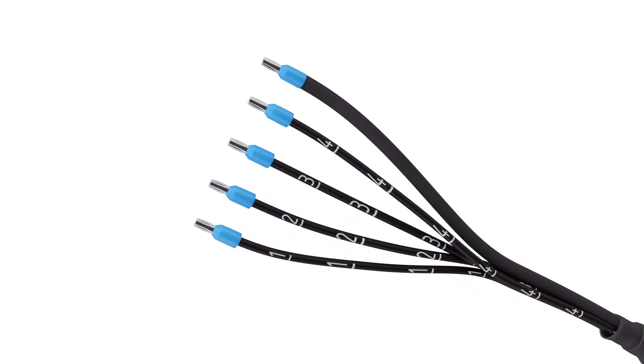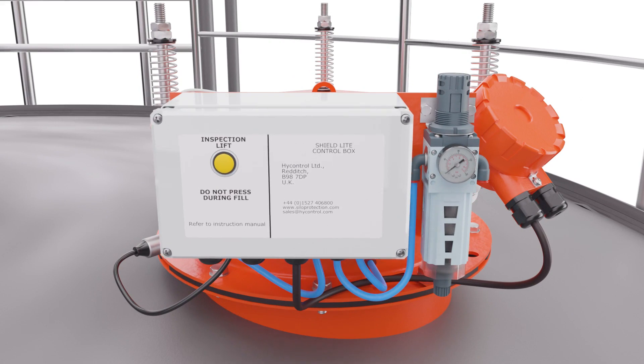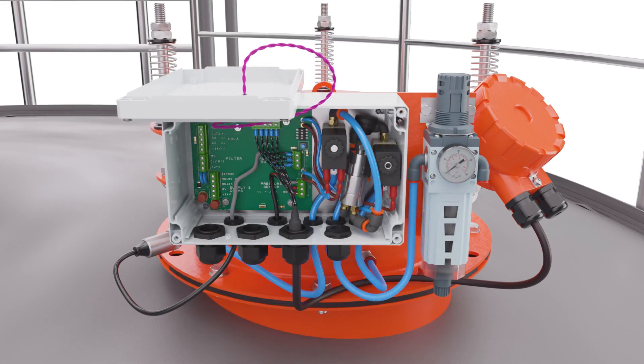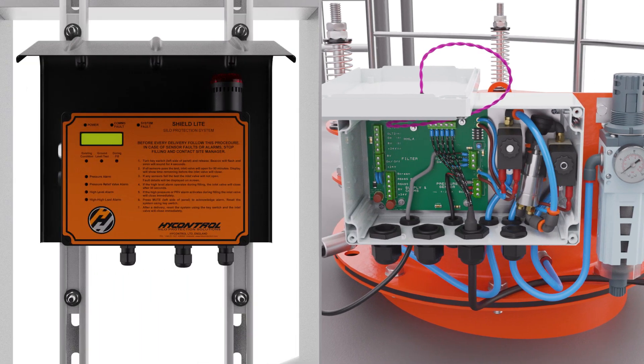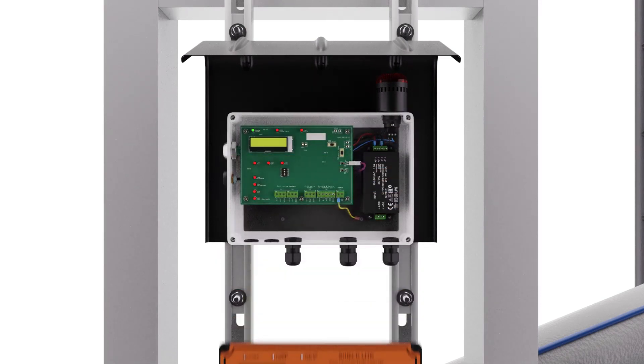This connection requires a 4-core screened cable from the top of the silo to the bottom. Start by removing the cover of the control box on the PRV. We recommend putting the front face on top of the box to avoid damaging the wire for the local PRV lift inspection and test button. The wiring to connect the silo top PRV control box and the display box at the fill point is the same at both ends, as we will now demonstrate.